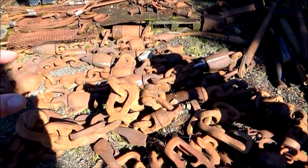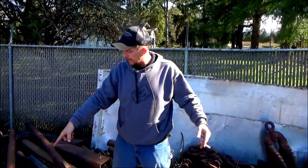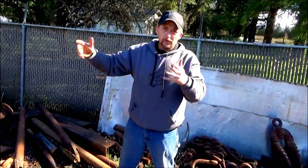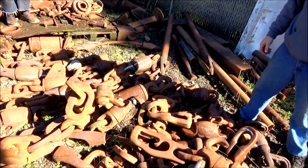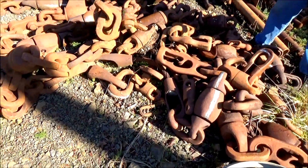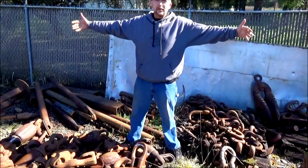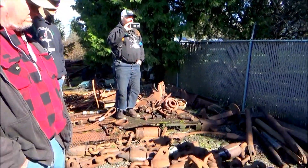So we've got the carriage on the skyline. Back in the old days they'd run the haul back out to the skyline and put this — because it swivels — in between the haul back and the skyline. It's called high lead because it's on the ground most of the time. If you hold your skyline tight you can pick it up, but it basically drags the ground with three or four 40-foot chokers hanging off it. You can only go about 60 feet wide to get your logs, then you change roads. If you're the green guy you always got the back choker because the back choker cleans up the front.